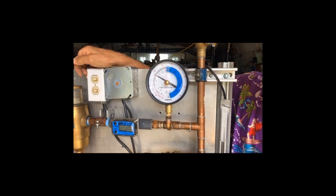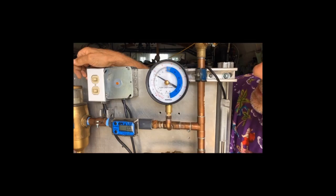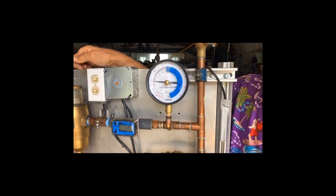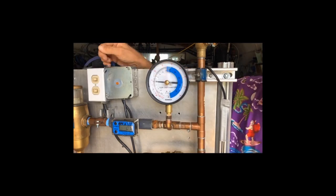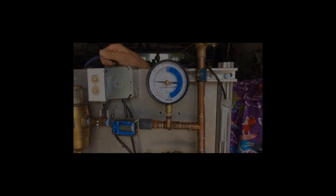I'm going to turn that off, and I'm going to pump at the point of no pressure change by opening this other valve down here. Pay attention to that gauge. I've gone down to a negative pressure — about minus 2 psi. If I put my hand on that air vent, you'll feel air is being pulled into the system when I pull into negative pressure. So that's what happens when you pump at the point of no pressure change as opposed to away from it. Simple enough.